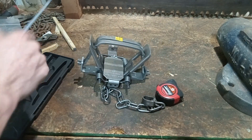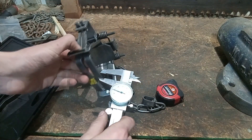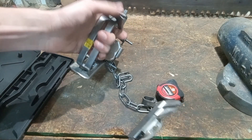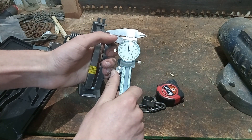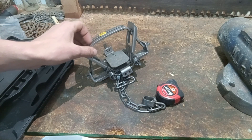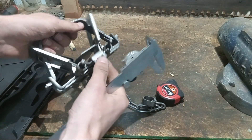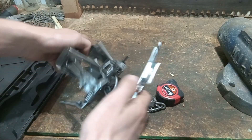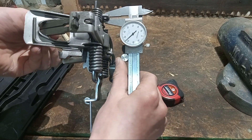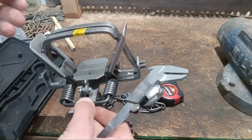The offset is 0.24, so we'll say a quarter inch. The thickness of the jaws is 0.175. These levers here are 0.069 — about 0.068 or 0.069 — which I believe is 14 or 16 gauge steel. The cross frame measures roughly 0.131, so just a hair over an eighth of an inch. It could be coating, oil, or mill scale on there, or it could just be an eighth of an inch.